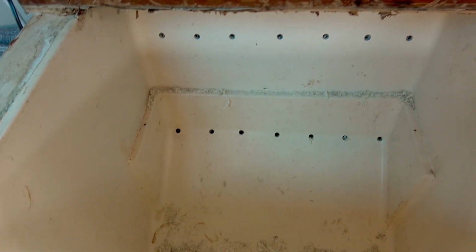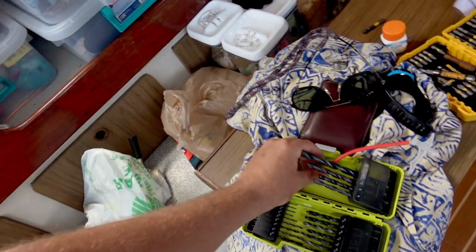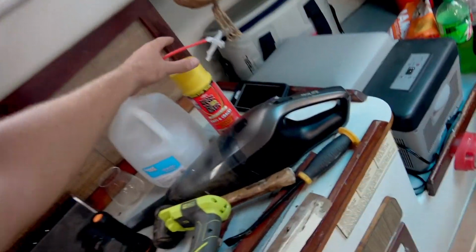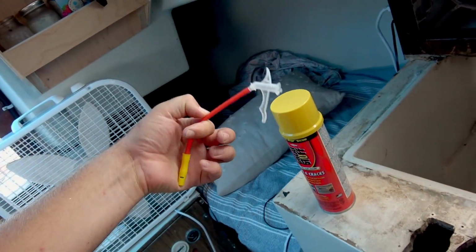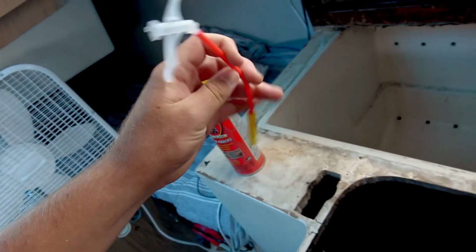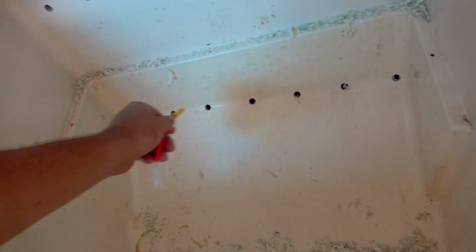Okay, if we take a look here, those are holes I drilled with that size one. So what I can use is this insulation foam that's called Great Stuff. I can use this on an angle because it can kind of twist, and then I can feed it through this hole and go down and all around like a squirt. Go around each of these holes. I'm going to do another set of holes here, and then I'm going to run some holes along the side here,